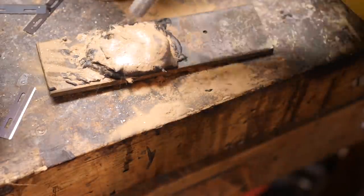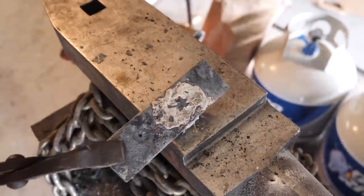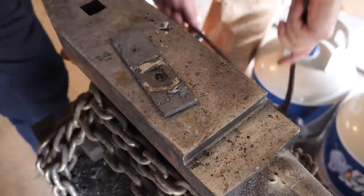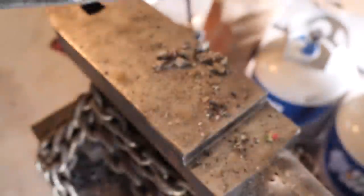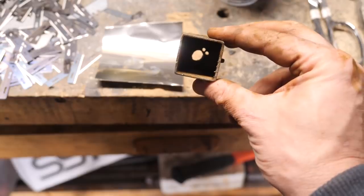We'll try with some more bronze powder and just see if we can get it done with this amount. Still no dice. I'm beginning to wonder if maybe the furnace cement soaked up some of the powder. So in an effort to circumvent the furnace cement, I'm going to use this contraption with some steel foil on the bottom and we'll see if we get a different result.